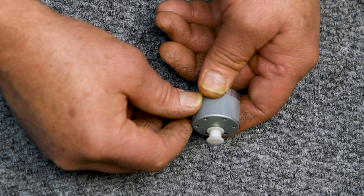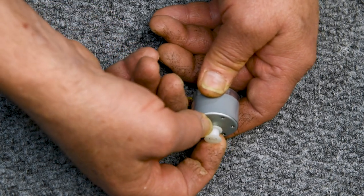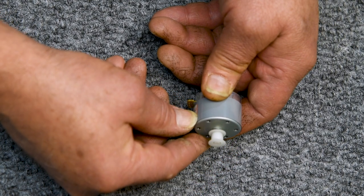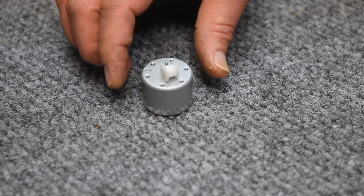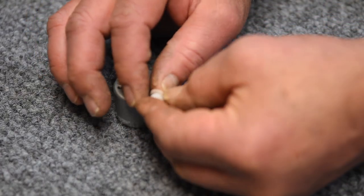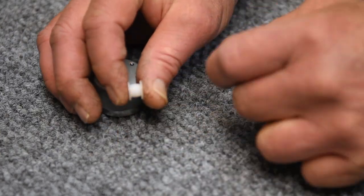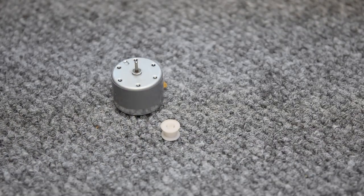What I want to do is stabilize the rotational inertia of this motor a little bit. There's not much weight on this plastic, so there's no mass to really help the motor reduce that ratcheting effect that DC motors have. The other problem I wanted to mention was that the casting works from the original mold on both sides had very pronounced mold marks on it - and you don't want that on your motor pulley when you're trying to reduce wow and flutter.